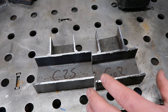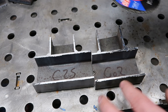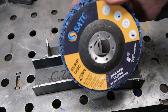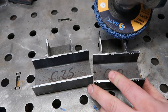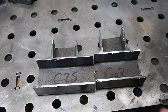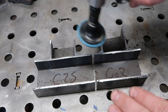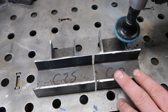Now that we got these things all cross-sectioned out and marked — this is our 75/25 and this is our CO2 — we're going to prep them with a 120-grit flapper disc first, then switch over to one of these paint-stripping pads to get a little finer grind on it. The last thing we're going to polish with is one of these blue-green Scotch-Brite pads. Make sure to do one pass in a certain direction, then the next pass in the opposite direction, so you're cross-hatching those lines and not creating lines that will show up in the etching process.